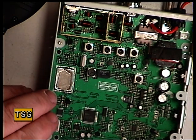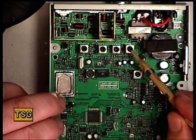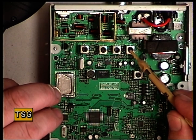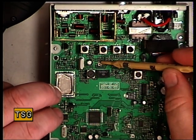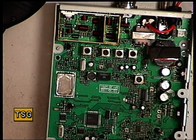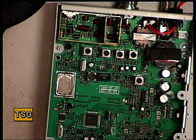That's it — there's nothing more I can suggest on adjustment. We've got a little bit more out of the receiver with careful adjustment of the transformers, brought the detector up, and set the squelch preset. That's all I can say without a full service manual on the Team TS6M. What we'll do next is an on-air test to see how it performs when we plug it into the aerial.